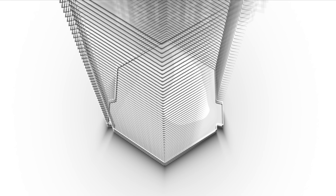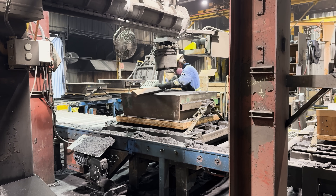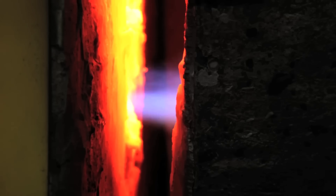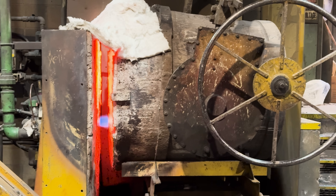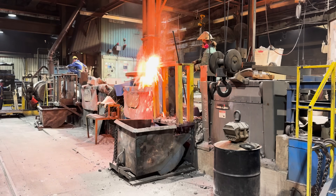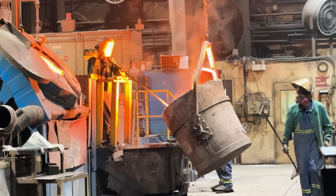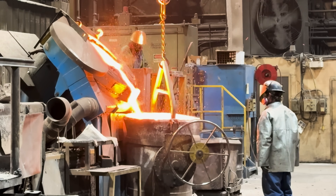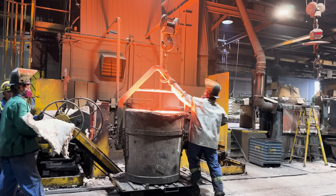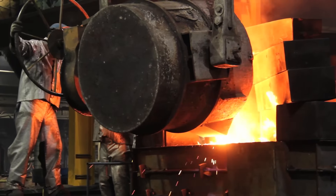From there the next step is moving over to the molding area, and then this mold would go down to pouring. We have three 5,000 pound induction melting furnaces. When you're melting metal you're operating at high temperatures and the metal reacts with the atmosphere, so you get slag on top. We're going to watch him remove any slag, take it out of the metal and put it into the slag bin, then empty the furnace into a ladle and transfer the ladle across to the pouring floor.